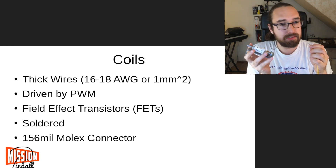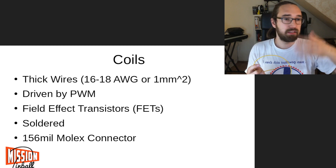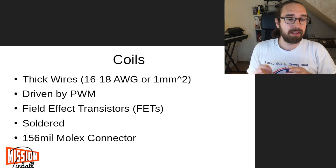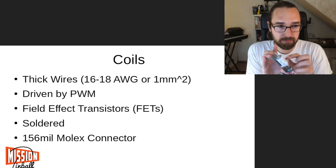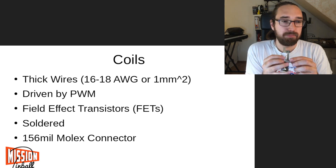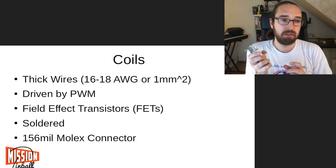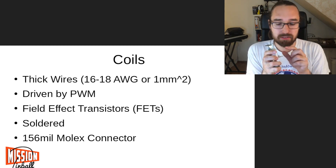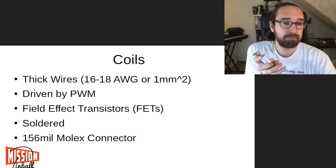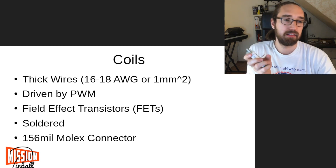Even with protective resistors it's not great, because those wires act like a large antenna and create interference with other devices - your lights, your logic, and even your neighbor's radio. That's why in production machines you should add diodes. I know many people don't do this initially in homebrews, and the danger is that if you invert the diode you will likely fry your field effect transistor - you get virtually zero resistance and the FET will just burst instantly and need replacement. That's a valid reason to avoid it during development.